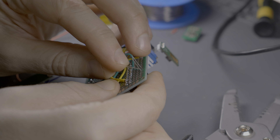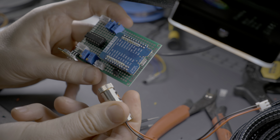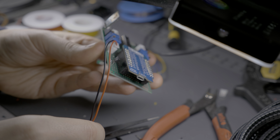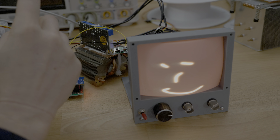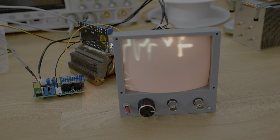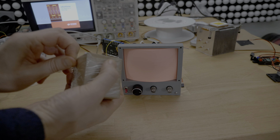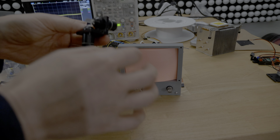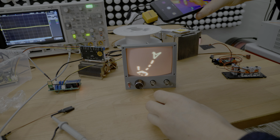First tests were promising but I needed to add the MOSFET to switch the laser. IO4 is controlling it. This is amazing — let's try to center it. That worked, but since this is cursed, only for a couple of minutes. Then the X direction galvo stopped working. I was really worried that the driver was damaged again. We swapped to the newly shipped galvo — it turned out the old galvo was physically damaged. It seemed driving it at these wide angles the galvos would die at some point.